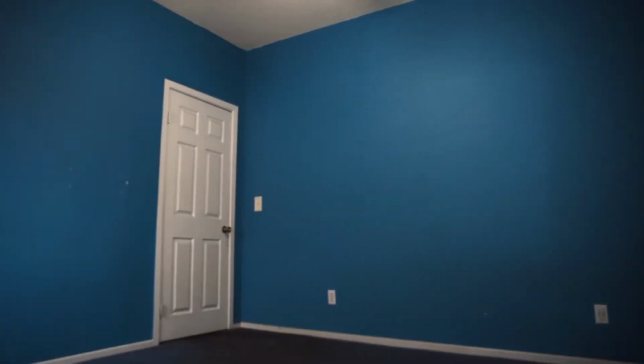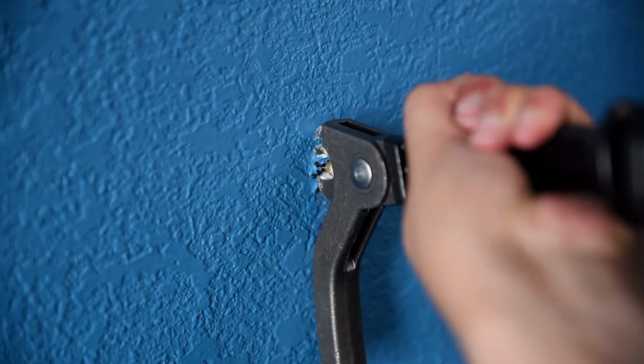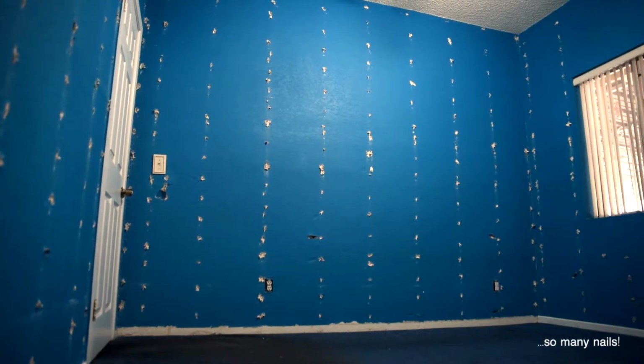For this video, I'll be giving you a quick walkthrough as to how I went about remodeling my room. This drywall was installed using nails only. I used the magnet to locate the nails, mark them with a Sharpie, and then used the nail puller to remove them. Links to the tools I used will be down in the description below.